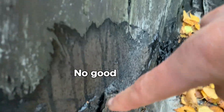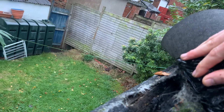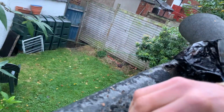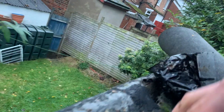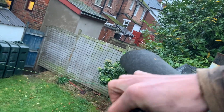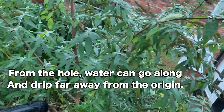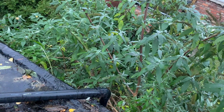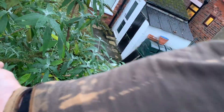Anything that can be a little hole, little pieces of something — this has been touched up already. Any edge, any actual physical hole where we found a culprit. This old product here — look at that. This is old, old material and then it starts to rip. That is the wood getting wet, and it's been going all the way down to this tree area, into the bathroom, into the other room. You don't always look right where the leak is — you should look everywhere because it can just go along this board inside.